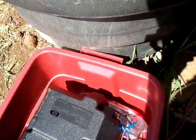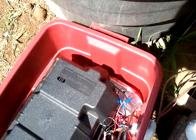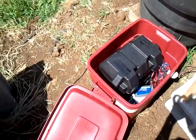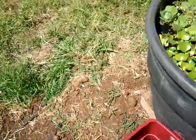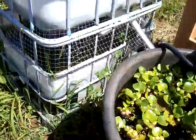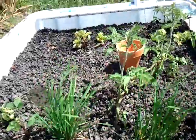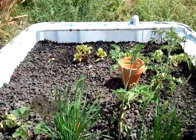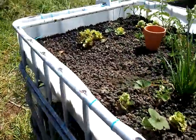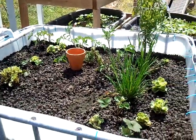In that little container back there I have an Arduino. I could not find a DC powered timer at the time which I could configure myself, so I put together an Arduino and programmed it. I have it set to power this pump — there's a separate pump that runs off of that battery which turns on for three minutes at a time, every ten minutes. So on for three, off for ten, and it does that all day.